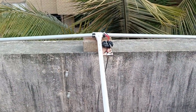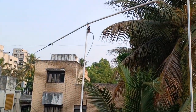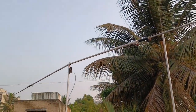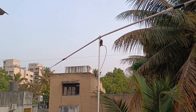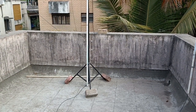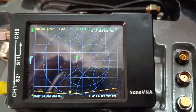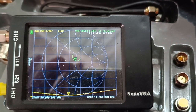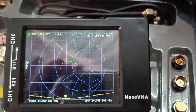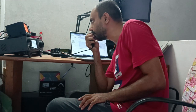I've put up the antenna — right now it is at 3 meters from the ground. I have adjusted the telescopic elements such that the SWR at 14.150 MHz is 1.1.